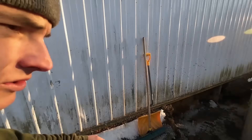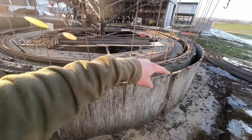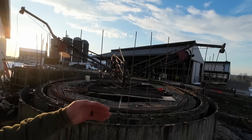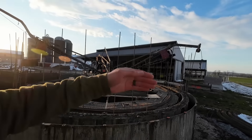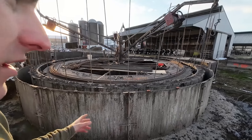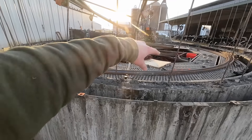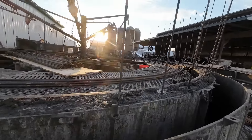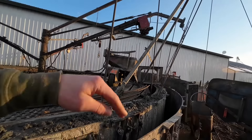The silo builders just took off — they're done for the day. Got the first ring poured. They set the form for the next layer on the outside and they're gonna lift that up tomorrow. They're gonna have three four-foot forms set up at a time and they'll just move the bottom form up to the top, pour four feet, move the bottom one up again. So they can pour up to 12 feet in a day — three different pours in one day once they get rolling. Today they had a lot of setup work getting everything right. They're planning to pour three layers tomorrow. The whole floor setup is going to rise with them as they're working. That concrete cart is hydraulic driven — that's what they're using to move the concrete around.